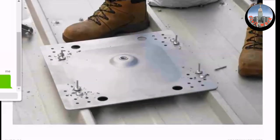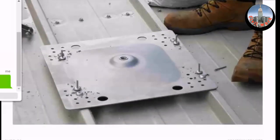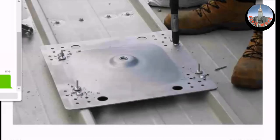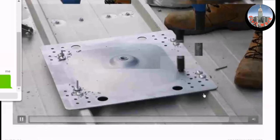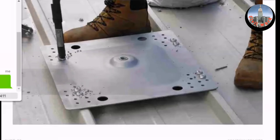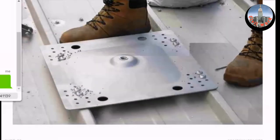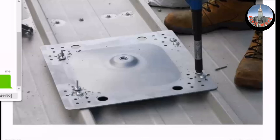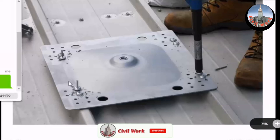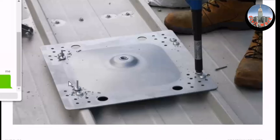You can see how the rivet works using the hand riveter — it's pretty efficient and quick, and you must pick up all the spent rivet stems because they end up in the gutter or staining the roof. Occasionally the rivet sticks a little bit. When it sticks, all you have to do with the rivet gun is pump it so the jaws come forward — normally a small part of the rivet is sheared off and stuck in the jaw. You just pump it so the jaws are open and then prise out the part that's stuck. It's pretty self-explanatory but something you need to check.